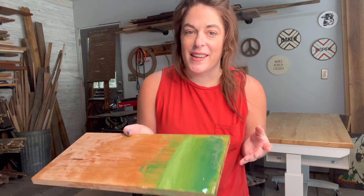Well, I had to wait until the next day — you guys don't have to. Here we are on day three and I have already jumped into sanding with 80 grit. I decided not to run it through my planer because I didn't want to risk planing off my whole design, plus it's not really good on those planer knives. I started with 80 grit sanding front to back, then switching to 120. When you're sanding, make sure you're not just focusing on the epoxy area or that area will end up thinner than the rest of the board. Make sure between grits you're getting all the dust off to prevent sanding swirls. I'm finishing up with 180 grit and I've got all the excess epoxy off. Now I'm adding water to raise the grain, then I'll switch to 220.